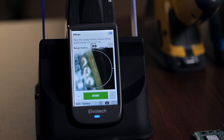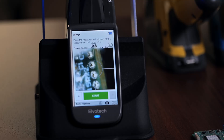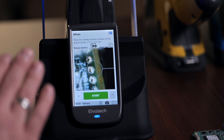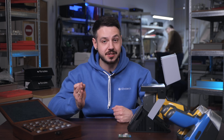We calculate from the right side: one, two, three, four — and here is the fifth one. We change the collimator to a 2-millimeter one and carefully separate the target pin from the others. After positioning is complete, we start the measurement. We also changed the analysis duration to 15 seconds, because when working with small parts it's better to double-check, and 15 seconds is absolutely enough for small metal particles.